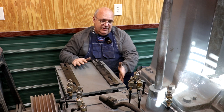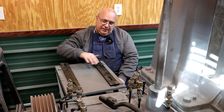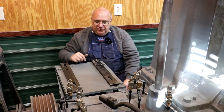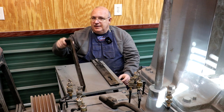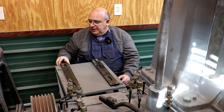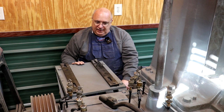This is where the original motor was mounted. On the back of the machine they had a welded-up bracket that bolts to the machine, and on top of that is a plate — probably half-inch thick. On top of that they had two metal bars. Notice there are some slots with bolts that went down, and then four tapped holes where the actual motor bolted straight down. Notice on the ends it kind of bends around, and they had a set screw where you could adjust these back and forth for tensioning the belt. You could loosen the screws in the slot, tighten the set screws, and that would move the motor back and tighten the belts up. A nice little setup.